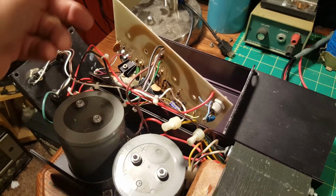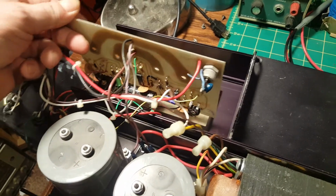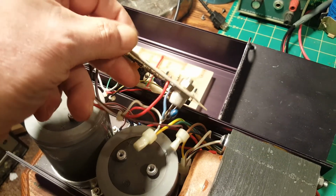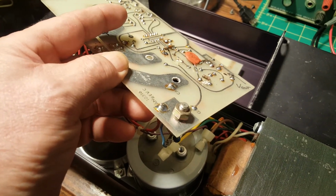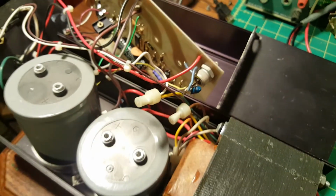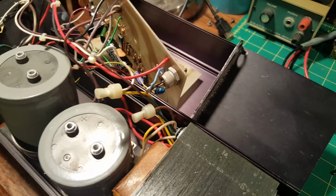Okay, I got looking at this original regulator control board in this NuMar supply, and the first thing that popped out was the big SCR. But I got looking at it, and in this case, it's not an SCR; it's a triac. And I thought, what the hell? And then I noticed, why the tiny little wire on that thing? That's not going to blow anything. That's no fail-safe. It'll just roast that wire in half once that thing triggers.